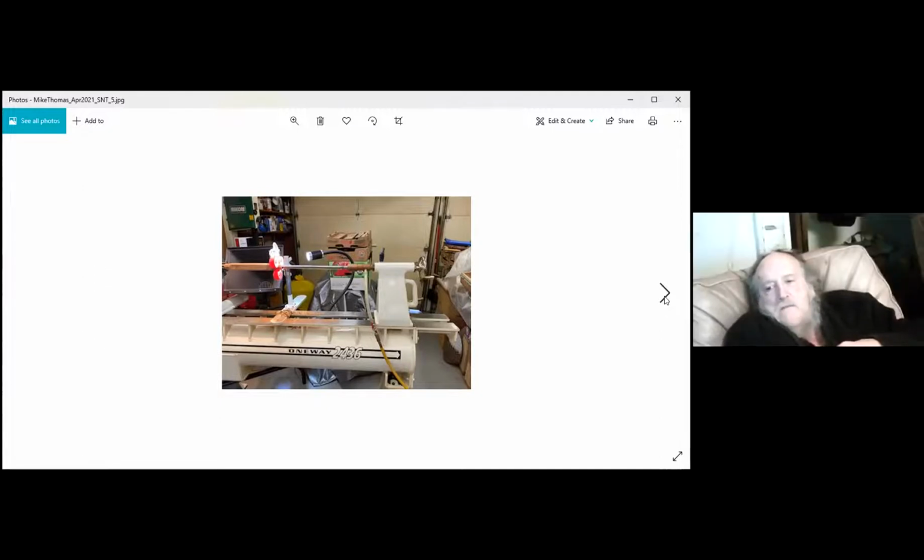Virgil Boyd was the first person I ever saw use one of those. He was making those goblets that he cut the spirals in, and he first drilled a hole down the center of them and would put in a contrasting wood. So you ended up mostly with a holly inside, 1/8 of an inch in diameter, and then a dark wood spiral that runs around it. And I took a pipe that I was making out of boxwood to his house once, and it had an 8-inch stem on it. And he used his gun drill, and it was 1/8 inch. He stuck his air source in the end of the handle, and he pushed it in by hand.